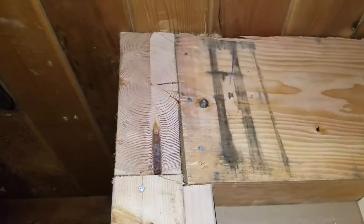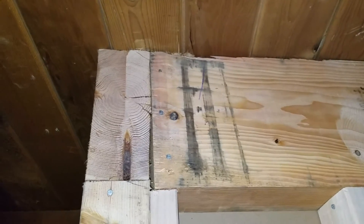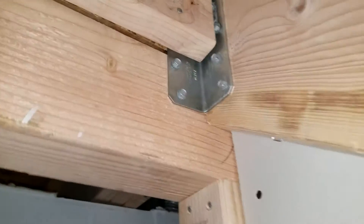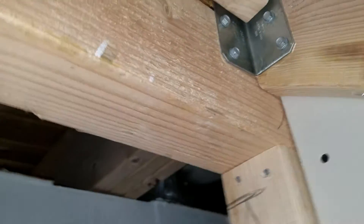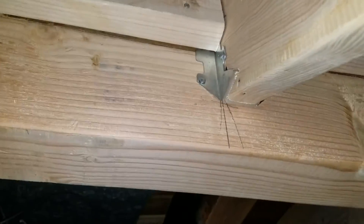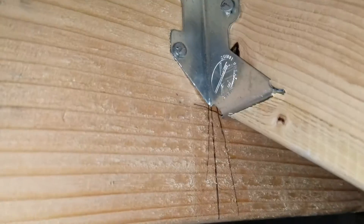The new beams are dimensionally larger than the old beams. The old ones are nine and a quarter, the new ones are nine and a half. Four by four posts in the middle, and there's what the stair stringers look like from underneath. Over on this side, we have the heavy angle brackets with three and a half inch screws that go into the beam and frame it on the side wall. And then it's the 2x8 joist hanger notched on this one.